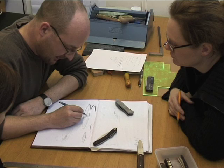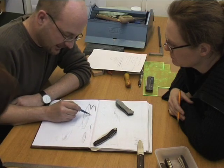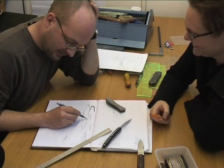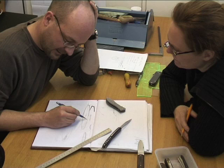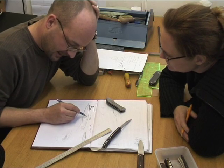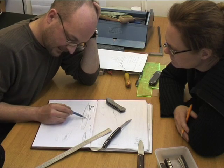The next thing I'd look at is the depth of the spine. I want to make this knife from three mil material — I've decided. So if it's going to be three mil, I just know from experience that the minimum I want to go on that at this stage is three mil. So I can kind of sketch in where that's going to sit if I want to preserve this top line.